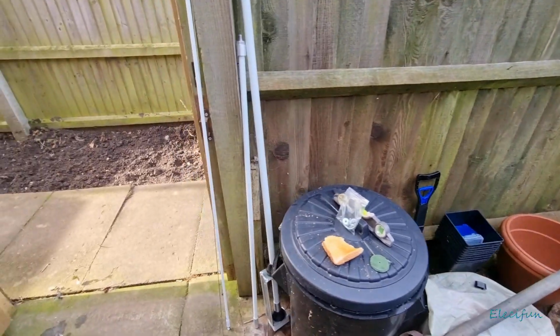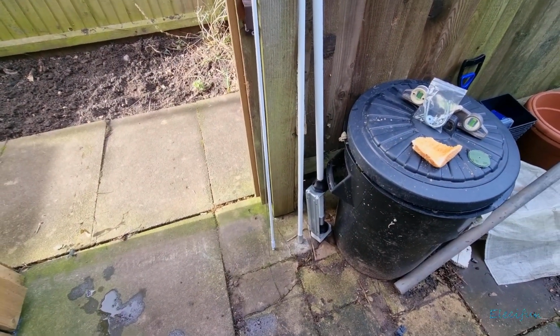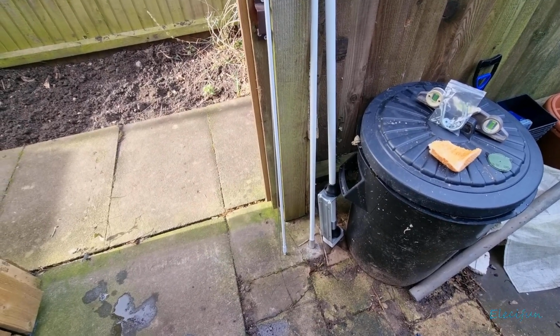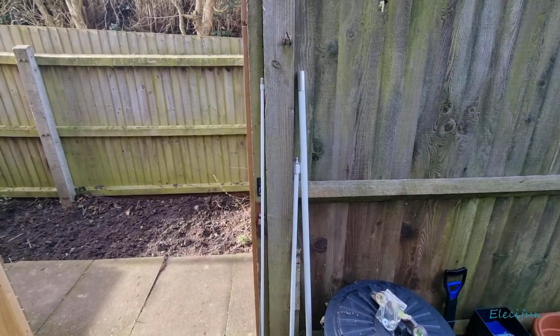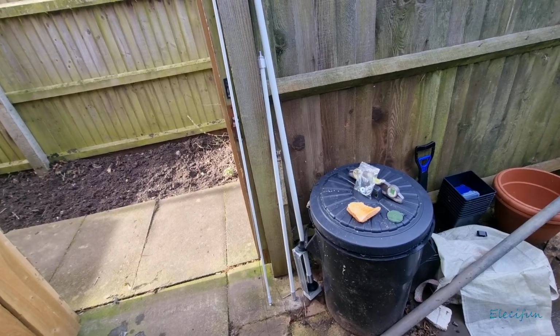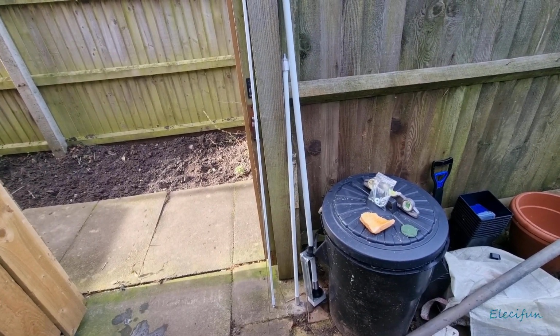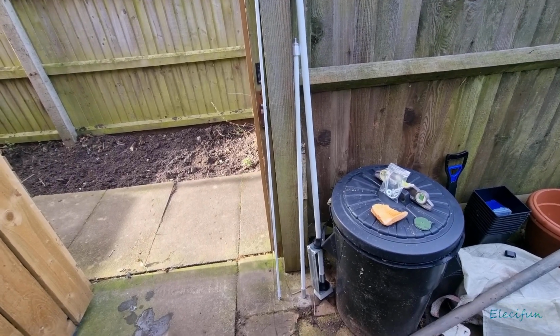And we're going to stick up this other white stick. This is a HF Sigma Euro, SE-HF-360. 5.5 meters long, and it's for the HF bands. It covers, if I recollect correctly, 80, 60, 40, 30, 20, 17, 15, 12, 10 and 6 meters.